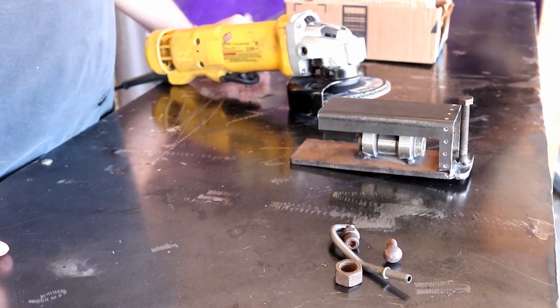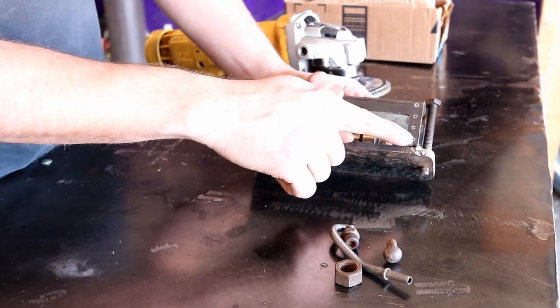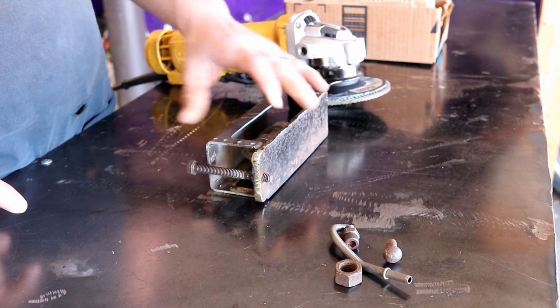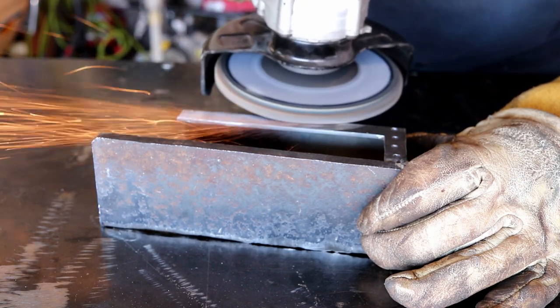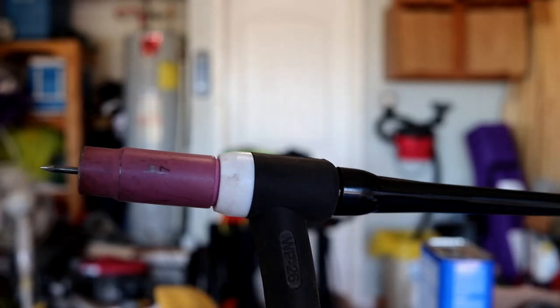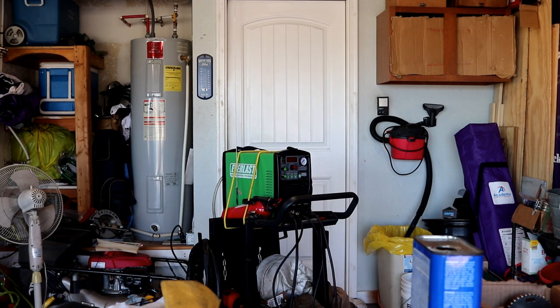The limits are the piece of artwork is going to be bigger than — I think it's three feet by three feet. I don't need to build something that big. Not the only thing different from where we left off on the Solo B-Roll Challenge video — I've drilled out three thirty-second inch holes here around the perimeter of this front. I'm going to do some cleaning up and then we will fill those in with a little something-something. This is the first chance I get to whip out the old TIG welder, the Everlast 206 PI, here on What We Weld In Weekly. This is the proper tool I need for the next step.